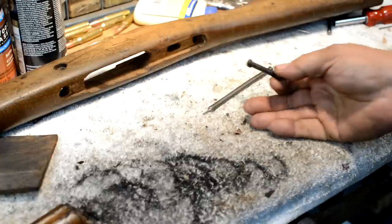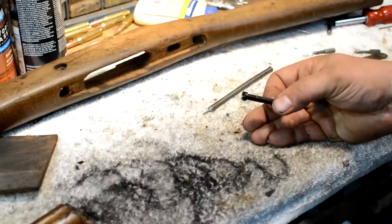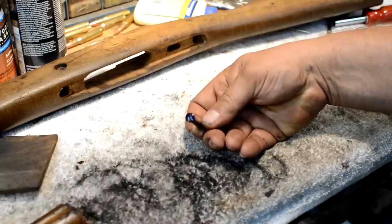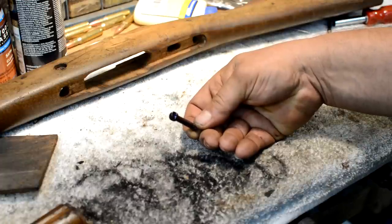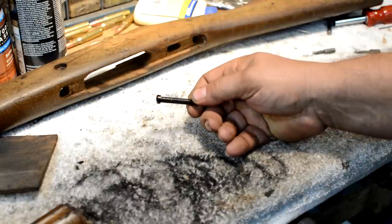Now, they would all have been set on a tray with a little bit of oil on them. They'd have stuck them in a furnace. They'd have run them up to about 490, maybe 500 degrees. They would have all been relatively heat treated, and it would have put a coat of finish on it that would hold up until the first time you started scrubbing on it, and then the whole thing would turn white. And then the oils in your hands and the salts would turn the whole thing brown, and it would look like what it looked like when we walked in here.